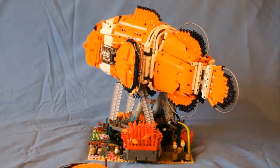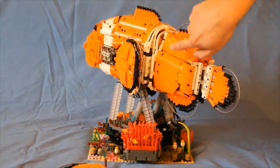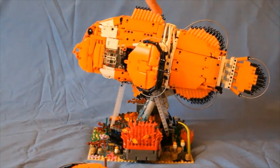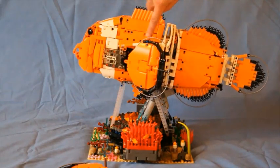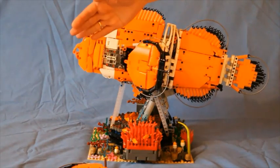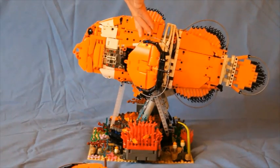That is my hope in the future to develop it that way. This is moving quite a bit of weight because we have the drive motor here, the function motor here, and a gearbox in the middle. All those functions have universal joints to go across to the main body. We have the tail swishing function at the top with rods that move in opposite directions, and the pectoral fin functions — with a crank that moves across to some suspension pieces and then forward and rear movement from a slider behind, which translates into cranks and levers moving in and out of the sides.